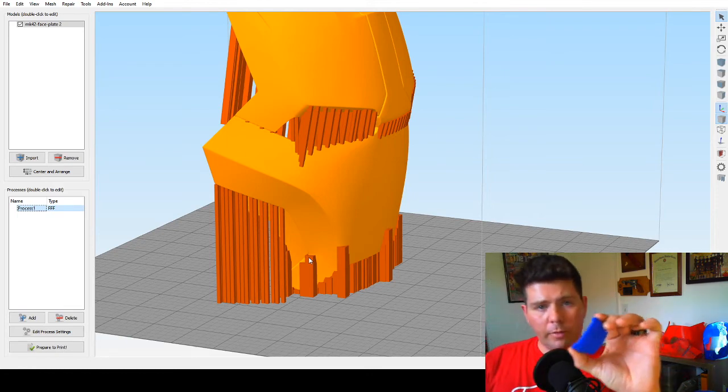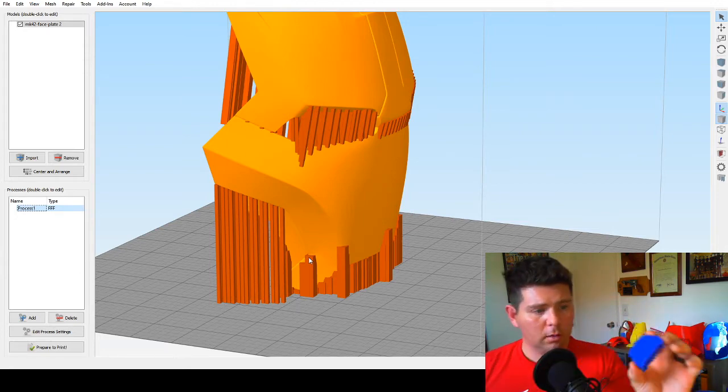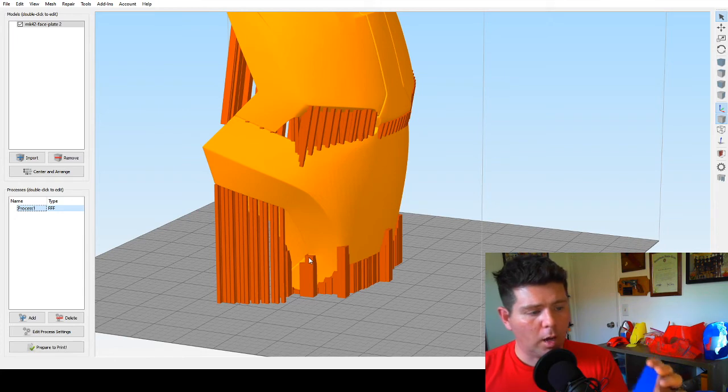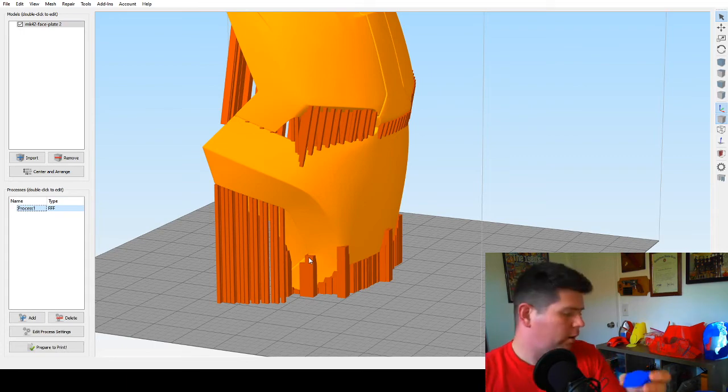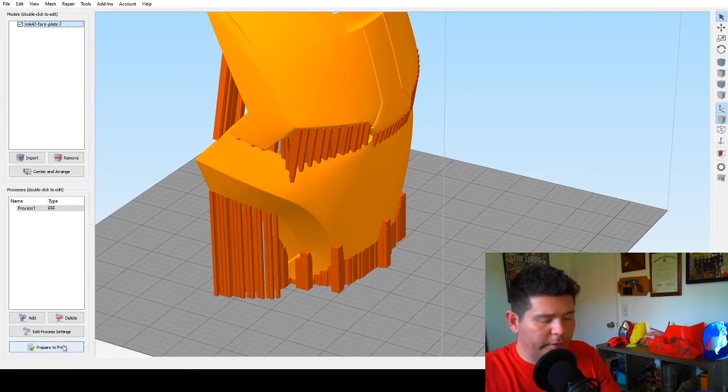When my supports come out, they're solid. They're 100%, almost, they're an X pattern, and it's solid. I do that personally because I don't want it to break away under any circumstances until I'm ready to take it off. So if you do it the other way where it's just 15% and it comes off really flimsy, it might not even support it. So that's up to you. It's individual preference. Figure out how you'd like to do your support material.